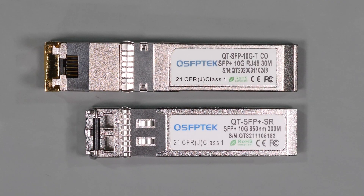We'll look at the power, temperature, and distance considerations that you should be aware of when selecting switches and network cards. As we've all seen standard copper RJ45 type connections, let's quickly look at some examples of a copper RJ45 transceiver.